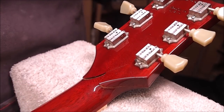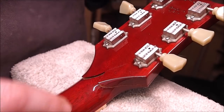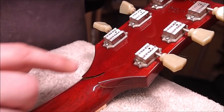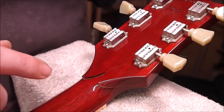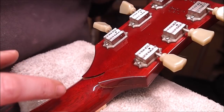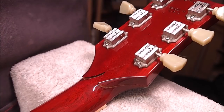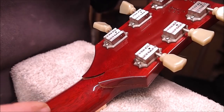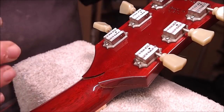Say 20 years from now, someone's going to buy this guitar, turns it over - oh yeah, broken headstock. If you see a couple of really nicely fit splines in there, it's almost a kind of assurance that someone really cared to have this thing fixed by someone who knew what they were doing. It's obvious that pains were taken. It certainly doesn't hurt, it can add some strength. If this thing ever breaks again, they often act as a kind of positioning device.